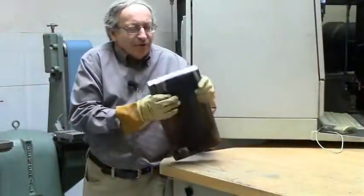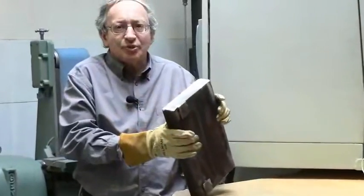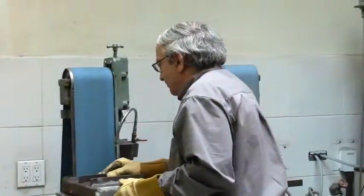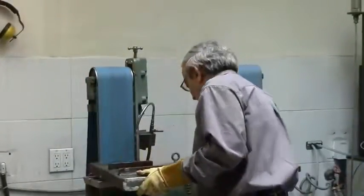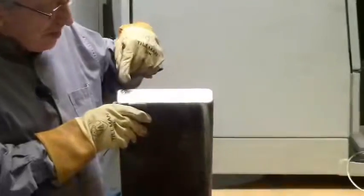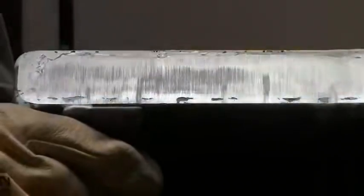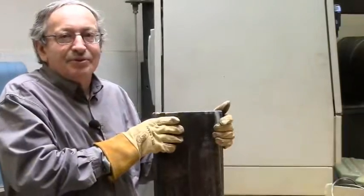So now we let the melted powder cure for about a minute or two, and then we let the whole thing cool down. Once it's cooled down, we just sand it and all the defects will be filled out. So now what you can see is the white powder which melted only stayed where there were dents. Obviously you're going to do it with the same powder you're going to coat it with, because this way you guarantee there will be no color show through.